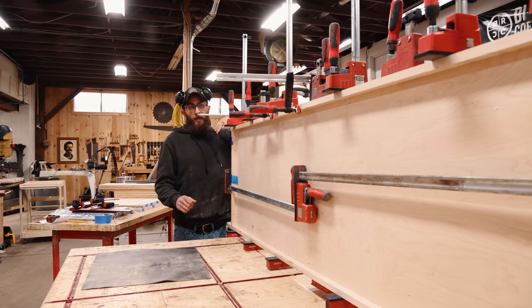I got a little ahead of myself and started doing this before I filmed it, so let me back up and explain. I went ahead and got this side all figured out. I took all the drawer faces and laid them out to figure out spacing, and then I like to make a story stick with blue tape where I measure out how big the drawer is and figure out where the drawer slide needs to go. I use that as a reference for putting the drawer slides together because drawer slides get very difficult very quick. I like to lay it all out first, then follow my story on the tape — then I can take a second piece of tape, transfer those marks to the other side, and we've got parallel drawer slides.